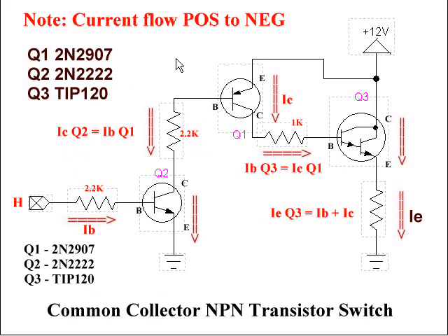So the purpose of this is to get rid of the power PNP transistors and use all NPN. This is a new circuit that I came up with, and it works quite well. Note, before I get into this, I'm going to use positive current flow and not negative as in the other videos, because people found it was easier to use. Both are correct — the military uses negative flow, and a lot of college engineering courses use positive flow. I'm going to stick with positive flow here.